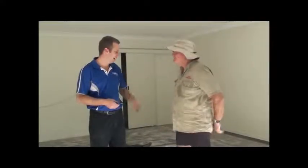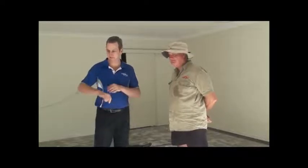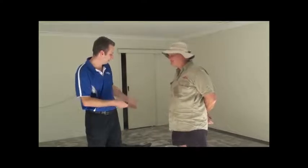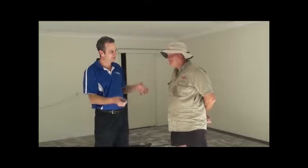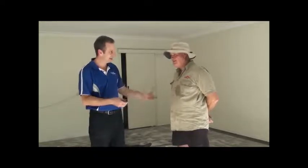So here you've now finished the preparation, you've done your patching of cracks, your divots, you've done your sealant around the edges. I see you're setting up now to do the roll coat. So garage granite, you're typically doing 4 square metres a litre for a base coat, but it can use more depending on how you're feeling on the job. Is that how you're seeing it?